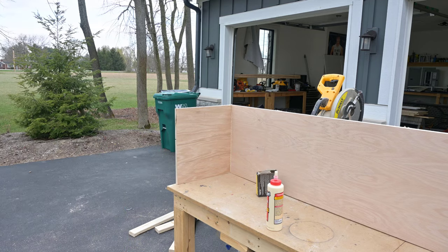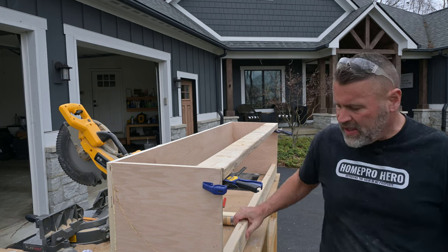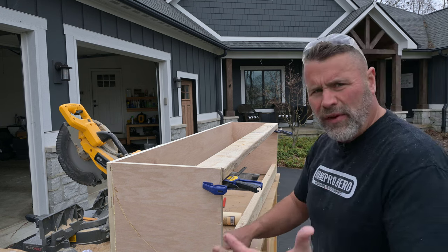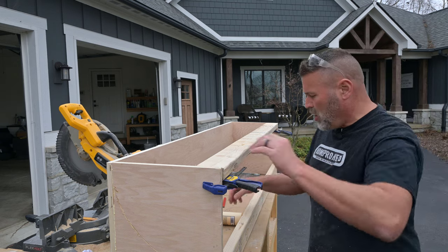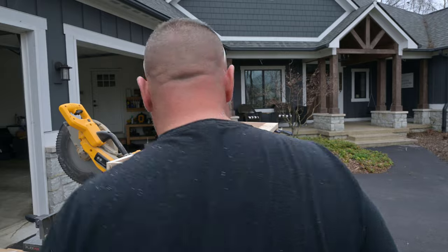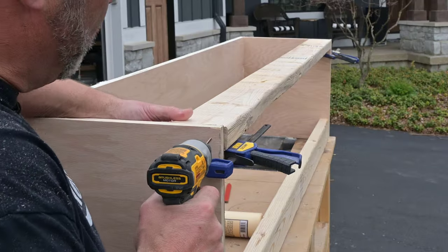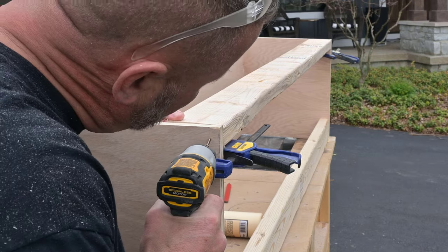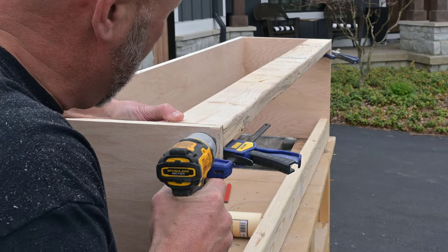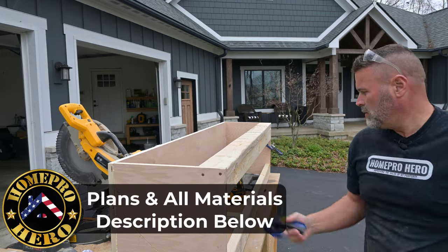I installed a 63-and-a-quarter two-by-four at the base — it's going to give me a mount at the very bottom of the bench. Now I'm installing the top one. We'll put two at the top, one at the bottom. This top one is going to hold the weight of the bench lid — basically my body weight — so it's got to be beefed up.